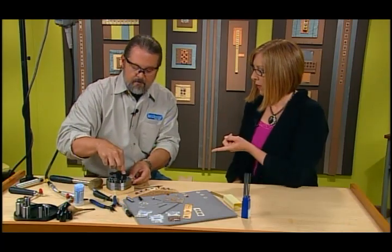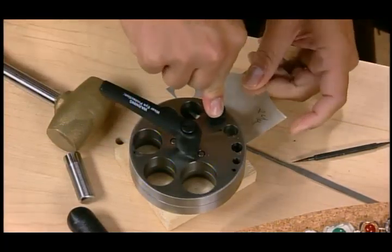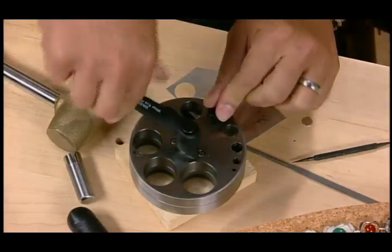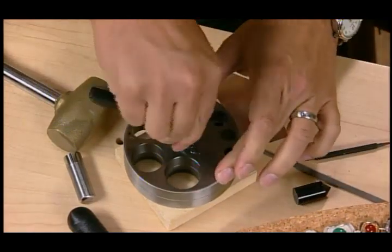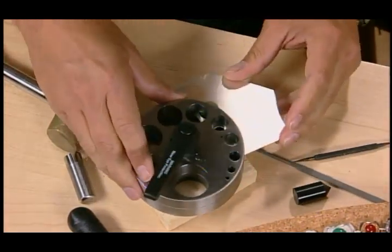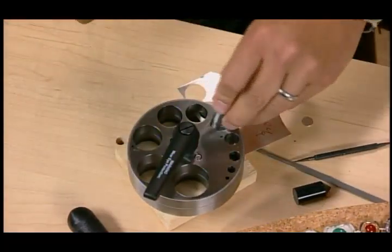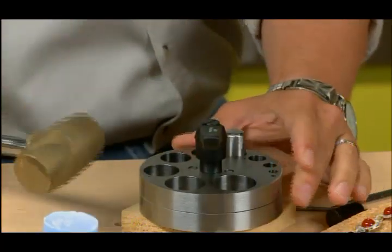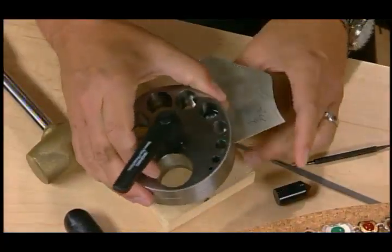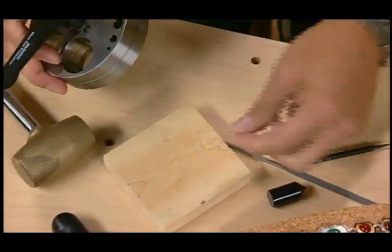So this part is for punching out the washer itself. Right. So we got our centering die. That's going to center the first hole that we punched. Oh, okay. And then we're going to crank it down. So you moved it to a larger spot on your... This is going to cut the outside perimeter of it. And this is 24 gauge, so it's pretty easy to do. The whole table shakes. Oh, I see why you want to protect your bench there.